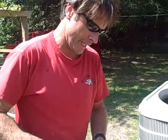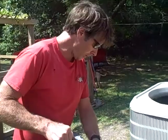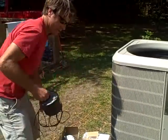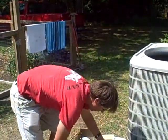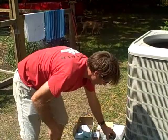It's that time of year again — hot out in the summer, AC units are going kaput in some cases. I'm just going to show you one of the problems that could possibly come up with the AC, and it's really the one you want to have happen. It's basically just your fan motor goes, and most likely your capacitor, which will turn on the fan motor and keep it running, just to make it simple.